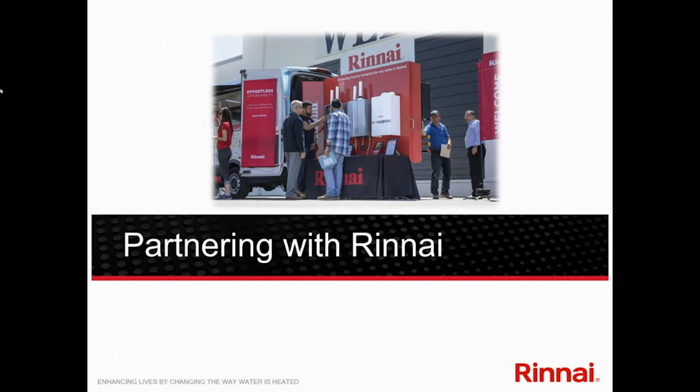I've run that many times. Where I run into it is, sometimes we're firing 199,000 BTUs for the domestic side, but yet we only need 10,000 or 15,000 BTUs for the heating side. It will compensate for that. The three-way mixing valve will compensate for that. There's a three-way mixing valve that mixes that water temperature, so that's built into the system. Does this unit start from the bottom and go up? Yep. It starts on low fire. All right.